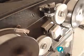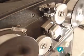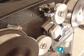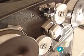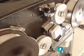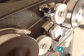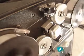One of the other disadvantages of a wire recorder is that the signal is polarized on one side of the wire, just like it is on a normal tape recorder. But being wire and being cylindrical in shape, the wire does turn around, which means that you do not always get the high-end frequencies — you can get a roll-in, roll-out effect of high frequencies on these machines.